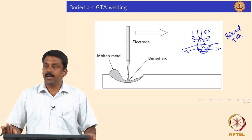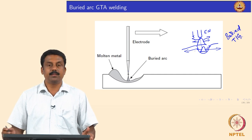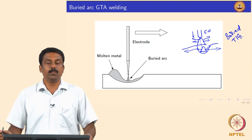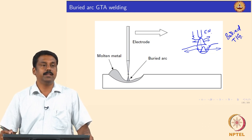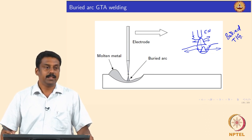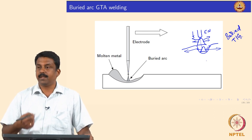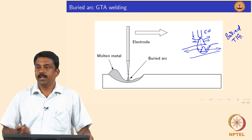In that case the penetration depth can be increased significantly. The key is that the plasma jet velocity must be controlled so it does not cause an explosion of the pool. By carefully controlling the movement of the electrode once the arc is struck, and with proper knowledge of the plasma jet velocity, we can create a stable buried TIG process. The heat transfer efficiency from the arc to the pool is increased tremendously, and by doing so we can increase both efficiency and penetration depth.